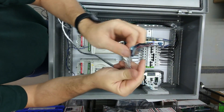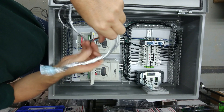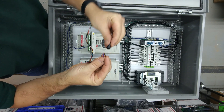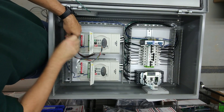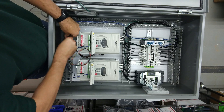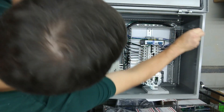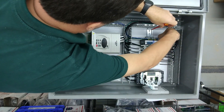We're going to discard the foil that's exposed — go ahead and take it off and cut it out of the way. One final step I like to do is take a piece of heat shrink and put it at the end where we've removed the PVC jacket. This is mostly just to keep the installation looking clean, but it also keeps that little bit of shield from fraying and accidentally hitting a terminal. We're going to take our shielded cable and route it up to our ground block and connect it.